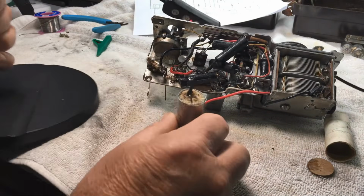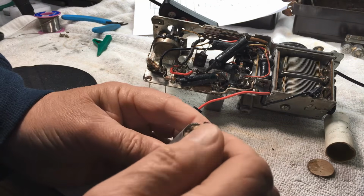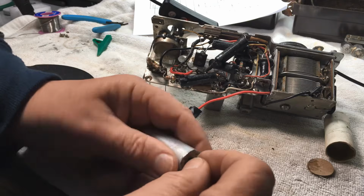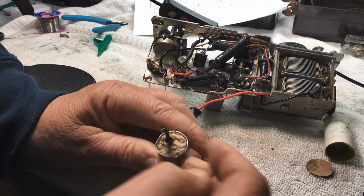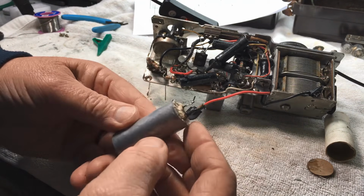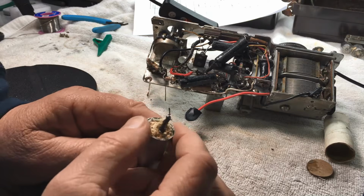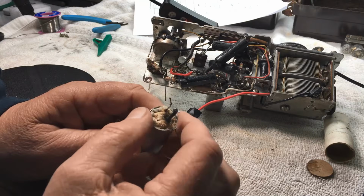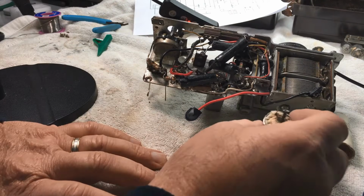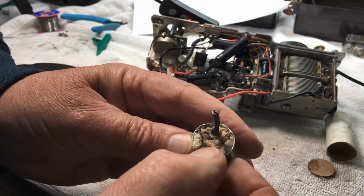I sort of couldn't believe this when I saw it. It's a shame I've lost the audio on this. But there's the remnants of the old capacitor. And I thought, well, this is fairly interesting. The insides of this capacitor have to come out no matter what, just to check out if anything's been done, or if it's leaked out, or what. I didn't know at this stage. Mind you, there's no bottom on the cap, and there was no mounting at all. The mount was gone. All I'm left with there was 2 leads going into the can.